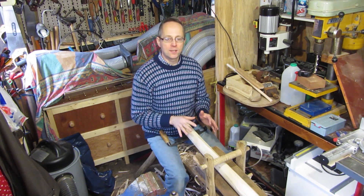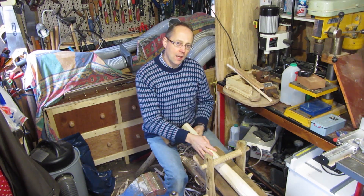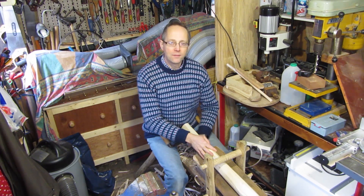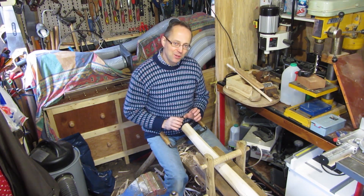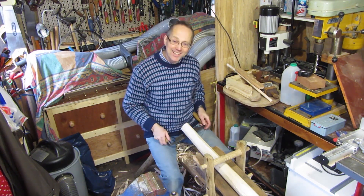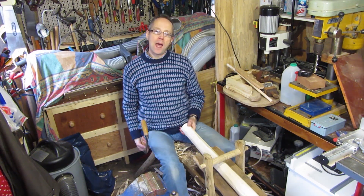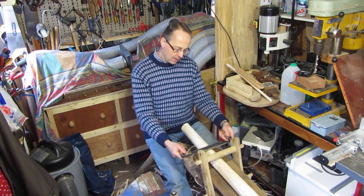After that — I'll probably do this as a separate film because it'll be a bit more involved — I've got to bend the rear legs and I'll probably be using my hot water bath for that, although I may steam them, we'll see how it goes. I've also got to do nice little curly tops which for a pole lathe will be a bit of a challenge, but life's about having good challenges. So I'll press on and get these draw knifed round and we'll take it from there.